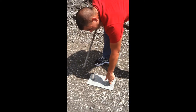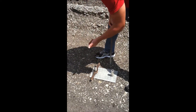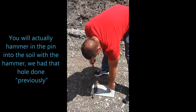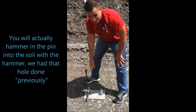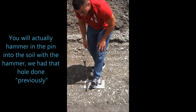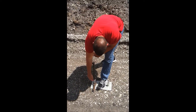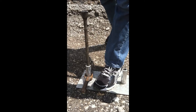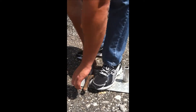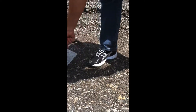You place the plate on the floor, then place the pin. You have to place this first — that's going to help you pull it out when you're done with the test. In this case we already have the hole open, so we don't have the hammer. But normally you're supposed to have a hammer and the hole shouldn't be pre-opened. The idea is: you place it, grab the hammer, and stick it down — bam, bam, bam — all the way to 6 inches and even lower to 8 inches. Once you're done, you pull out the pin, remove the plate, and you can see the hole.